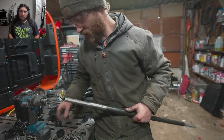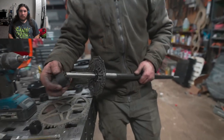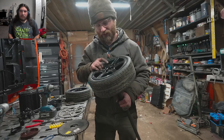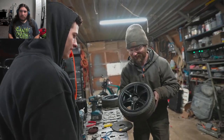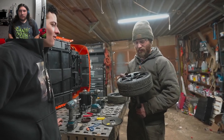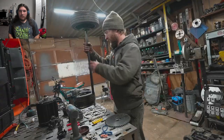The keyways are cut into both sides of the axle. Now the components can go on. There's a lot of things that go on there. One thing that's not spinning on the bearing — the bearing is just there to hold space. What they did is make front and rear wheels identical so they didn't have to make two different kinds of wheel. The bearing just centers it — it could just be a piece of bushing. It's probably less expensive than making two different molds.